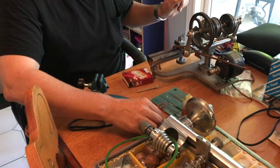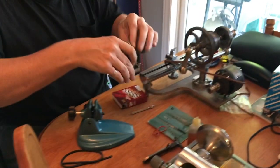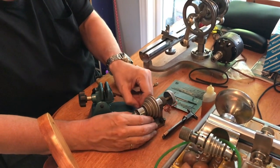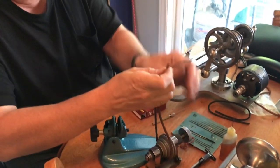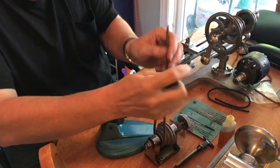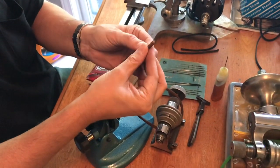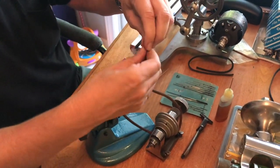To set it up properly, you take the headstock off the lathe. First thing you do is weave the belt through this headstock, because if you don't you'd have to take the whole headstock apart to put the belt on. So you take the headstock, rotating the pin there, and weave the belt through. Then you trim the ends so they're flat and parallel.